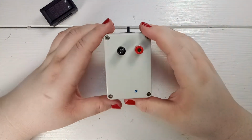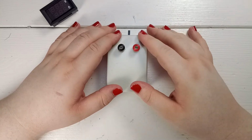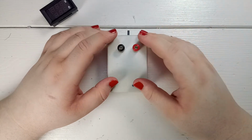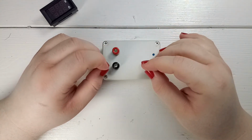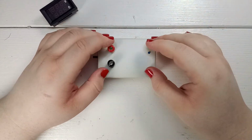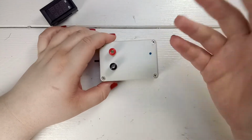Now, this over here doesn't look like much, but this is a voltage reference. It utilizes a Linear Technology LT1236BIS8-5. This chip has a 0.1% accuracy out of the box, and if you connect it with its trimming circuitry, you can trim it down to 0.005% accuracy. Now this in itself is a really straightforward process, just the voltage reference itself, because there is not much circuitry. There are only a few components, and you essentially have to follow the steps within the datasheet of the IC. If you use another one, you have to follow different steps and connect everything differently or use other components at all.